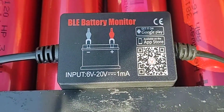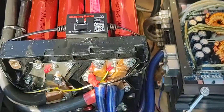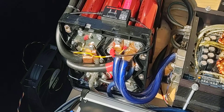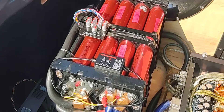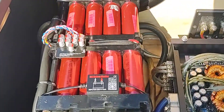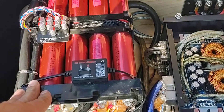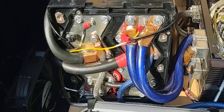As far as the battery, I added a little Bluetooth monitor — it's designed for lead acid but it works well enough to know your peak voltages. Make sure you don't go above 14.6V; that's the highest voltage these cells will accept. A lot of guys run 14.8V but I don't recommend it — you're just going to shorten the life of the cells and barely gain any capacity, maybe a couple percent. Honestly 14.4V is probably best for this pack; 14.6V if you're demoing.